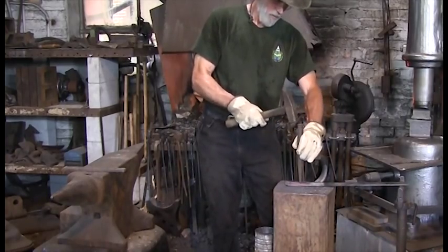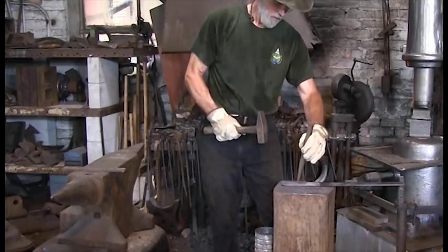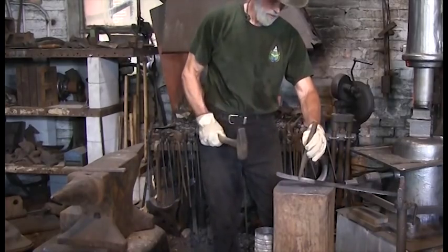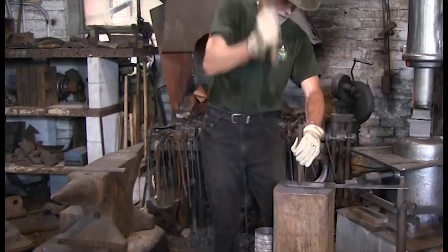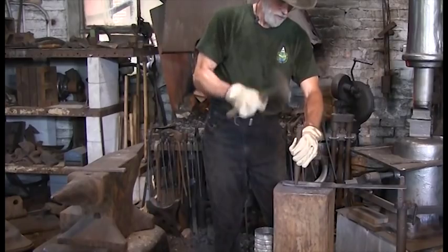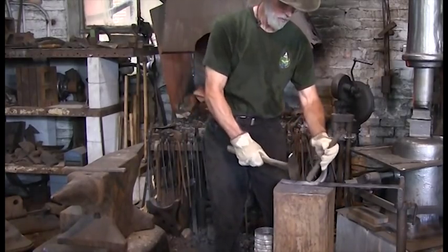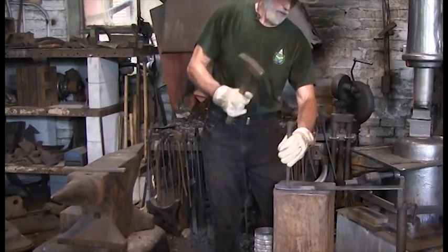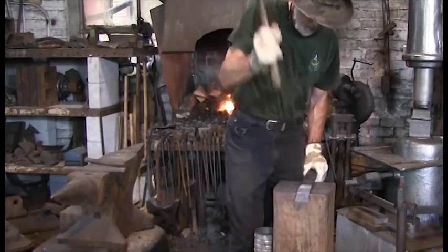To get a hard blow to the chisel, I rock the hammer back to the cocked position and then snap it down. The loose hand grip is absolutely critical. A tight grip on a hammer would cripple the blow and transmit terrible shock. You would hurt yourself getting nothing done. In blacksmithing, the idea always is to do as much as possible in one heat. Some operations can be done, and actually can be done more effectively, as the metal gets cold. Here, it breaks off almost like a piece of glass.